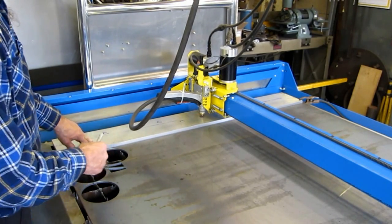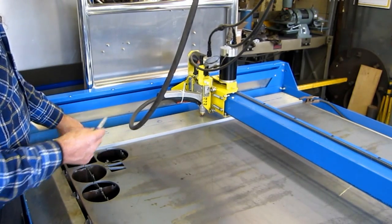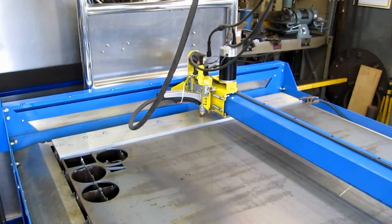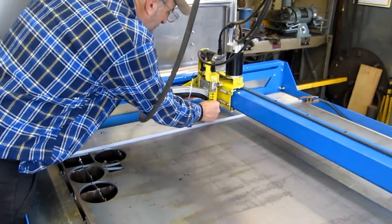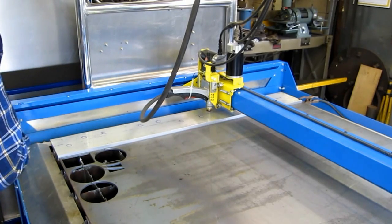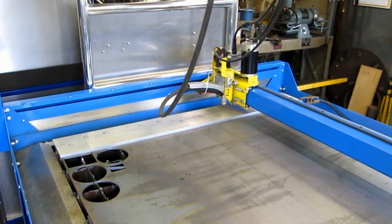This is three quarter inch and we're going to be cutting it with our 60 amp torch. What I'm doing is laying out pierce points and I'm going to pre-drill all the pierce openings. I'm going to the next hole, taking a sharpie and laying out where those pierce points are going to be. Then we'll drill this plate out, set it exactly back into this spot, and go from there. At least that's my plan - it's the only one I got, so I'm sticking to it.